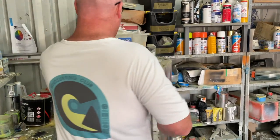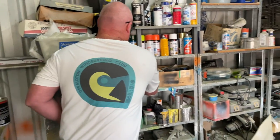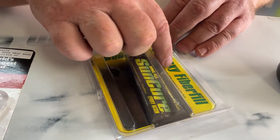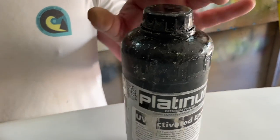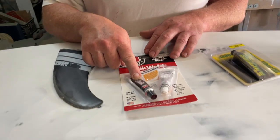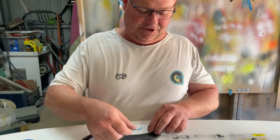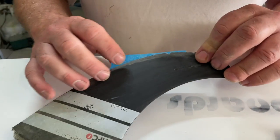The other way, if we were doing it on holidays, is we can use our solar resins. On holidays the things you're going to use for a temporary repair are solar resin - even better with a bit of fiber in it. I use quite a bit of the stuff so I've got a bulk pack, but you probably don't want to buy that at $100. The strongest and best result is the metal-filled epoxy; the UV solar resin is what you might use on holidays.